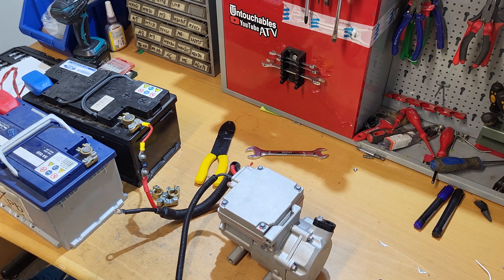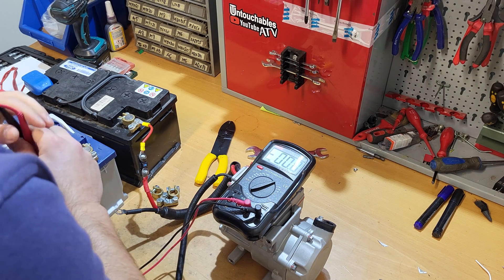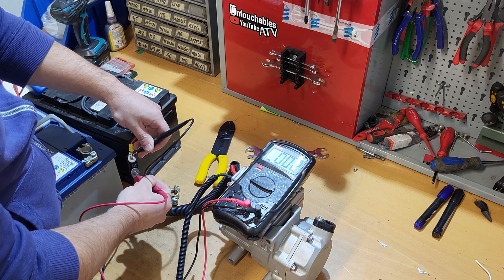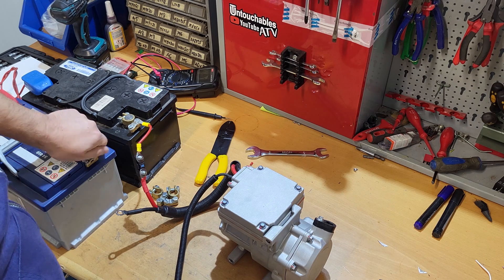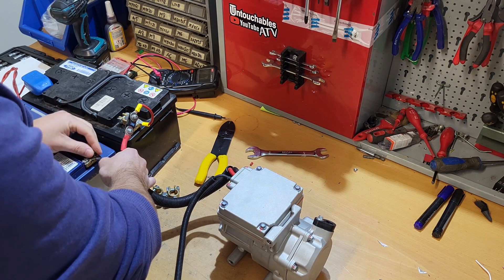Let's do a short look. We don't have a spark — could be that the fuse is blown. Let me bring a multimeter. It could be that our test was this short. Why even bother making the video? Let's check — we'll put it in diode mode. No, the fuse is still good.